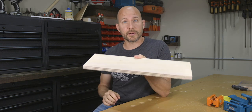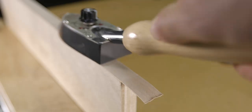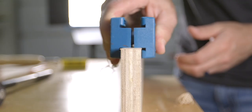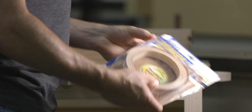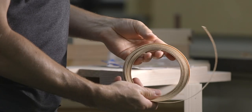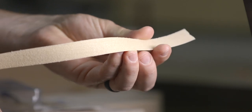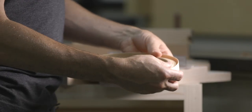The hardest part about building projects out of plywood is knowing what to do to finish the raw edges. In today's video we're going to look at one of the simplest ways to professionally cover those edges. The product we're using is an iron-on edge banding, which is a thin veneer of wood — in this case birch — that has a temperature sensitive adhesive pre-applied to the back. This product is widely available and if installed properly is quite durable.